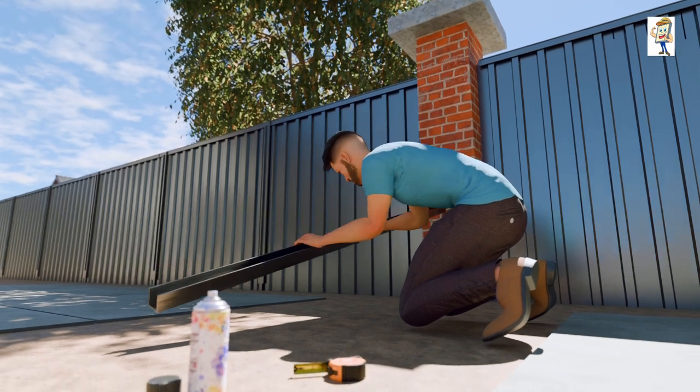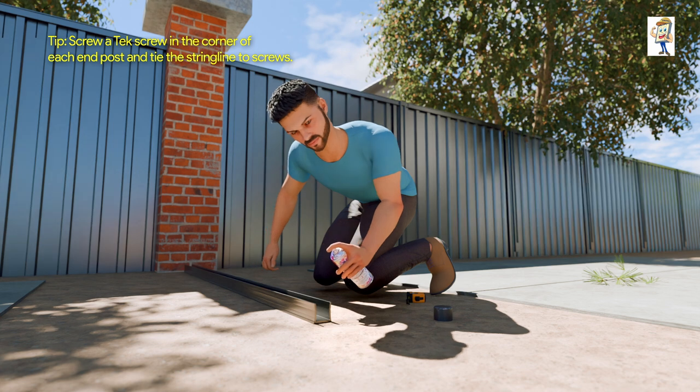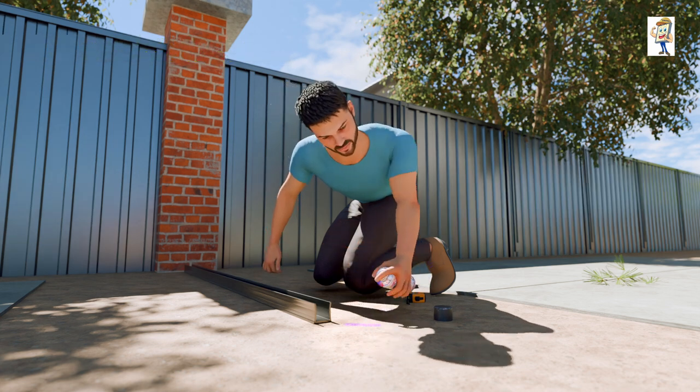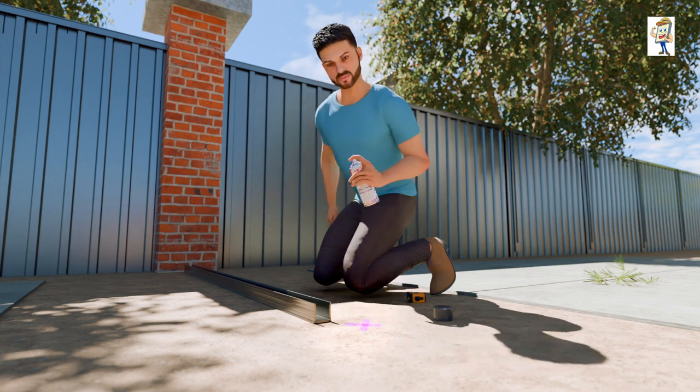Set the two end fence posts in the ground with concrete and level the posts. Use a string line to ensure it is tight with no obstructions like foliage in the way or to move it. It is a guide for all the other posts, height and alignment.